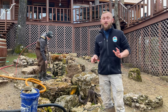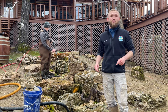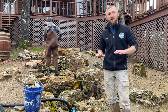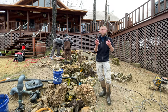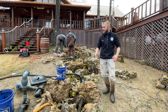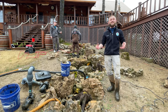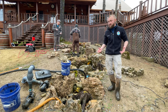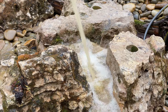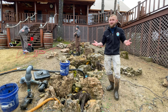The pre-rinse is done. Believe it or not, we have the majority of the sediment already removed from the entire stream. But the reservoir bottom is where most of the stuff actually settles out — it catches at the top where water filters through the three-by-fives, and then settles in the bottom section. You can see the pumps are already brown and nasty. There is a ton of sediment that builds up in those places, and it is designed that way purposely. Imagine if all the sediment in that sediment chamber was actually in your stream — but instead it goes underground where you don't have to look at it. Something's got to be done with it eventually, so now we're cleaning this thing.